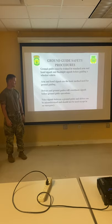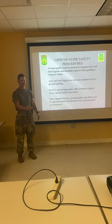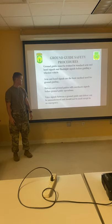Voice signals, you should avoid using these. Unless it's a dire emergency, like, you know, someone's about to hit someone else, someone's about to hit some equipment. So you'd be like, stop, stop, stop. You'd do something like that to catch their attention because maybe they were trying to do it themselves and they didn't realize what was going on.